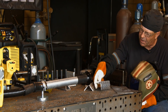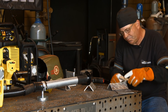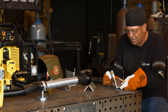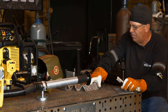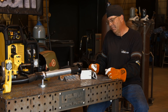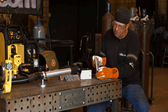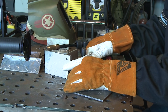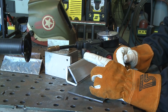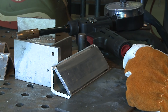We've got an outside corner joint that we did first, and then we turned it over and did an inside fillet, so this thing is pretty well sealed up. Next I want to experiment. A minute ago we did a downhill outside corner joint and I was kind of pushing it downhill. This one I just want to do flat - it's kind of a little fillet weld. I want to experiment: instead of running downhill, I want to drop the values and see if I can hit this and just go uphill with it, probably about 45 degrees.